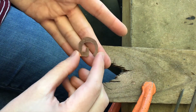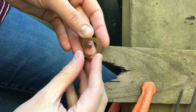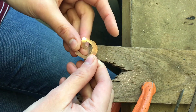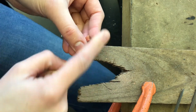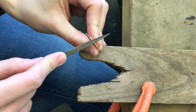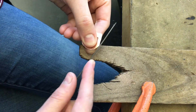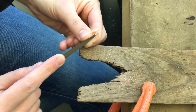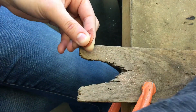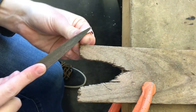Let me show you how to do a few other areas. I want to work next on this exterior curve — you can see it's pretty wonky and lumpy with a big bump right there. To do an outside curve, I actually want to use a flat file. Generally when filing I'm perpendicular to my metal, but for exterior curves it's easier to go parallel to the metal and follow the curve — more of a rounded motion. I personally like to use the larger files for exterior curves.